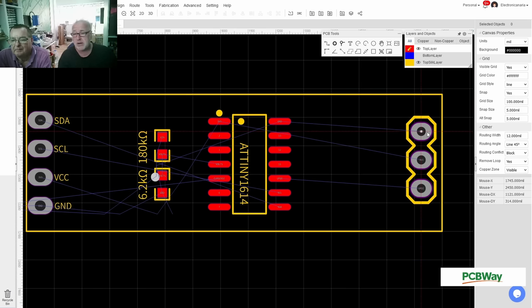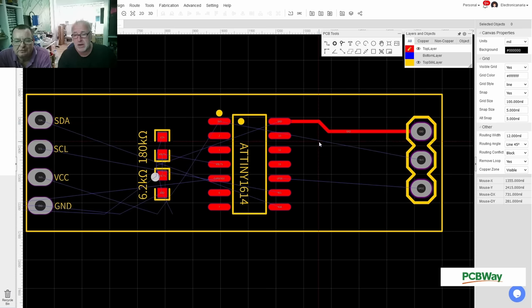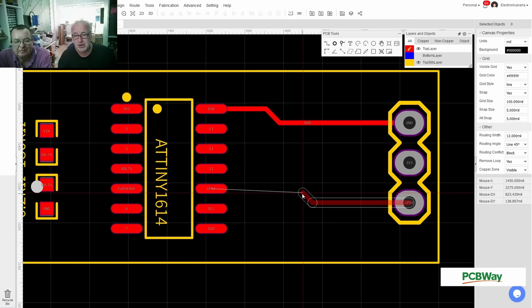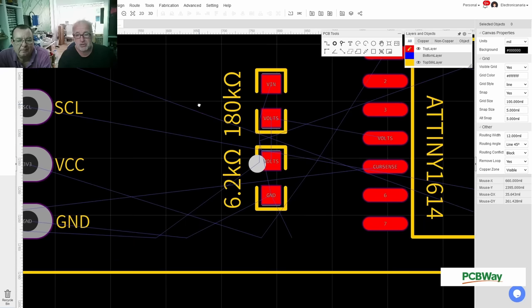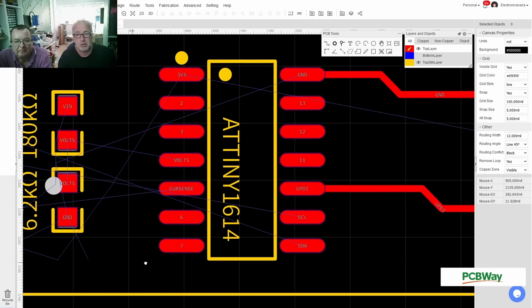So wire. Let's do the easy parts here. So you're not getting this to auto route this for us. Auto routing is horrible. Really, auto routing is really, really bad. Avoid auto routers at all costs. Maybe with some AI coming up soon, we really all hope. But right now, auto routing is a big mess. Correct. One big mess. This is really not nice.